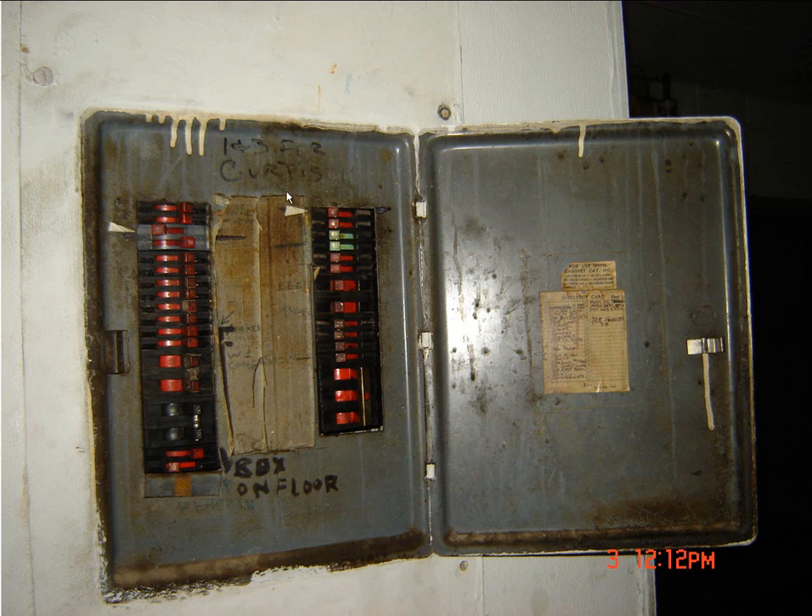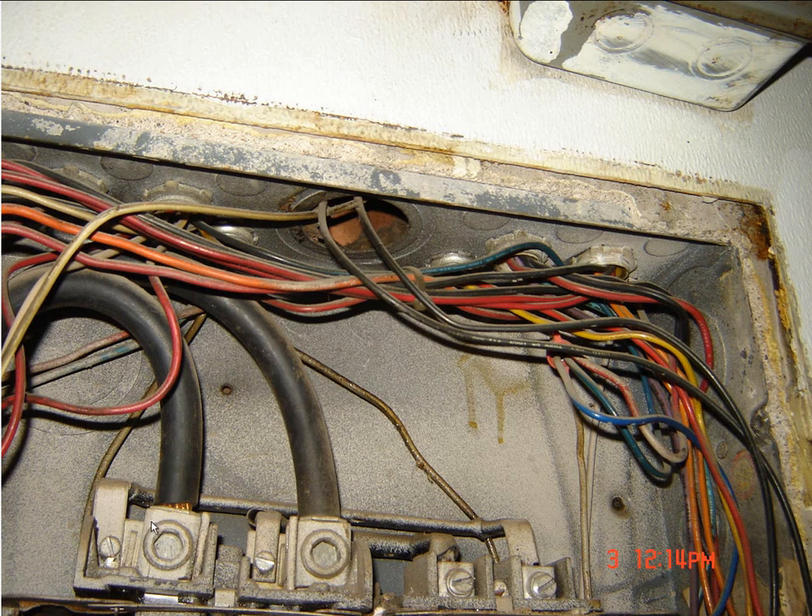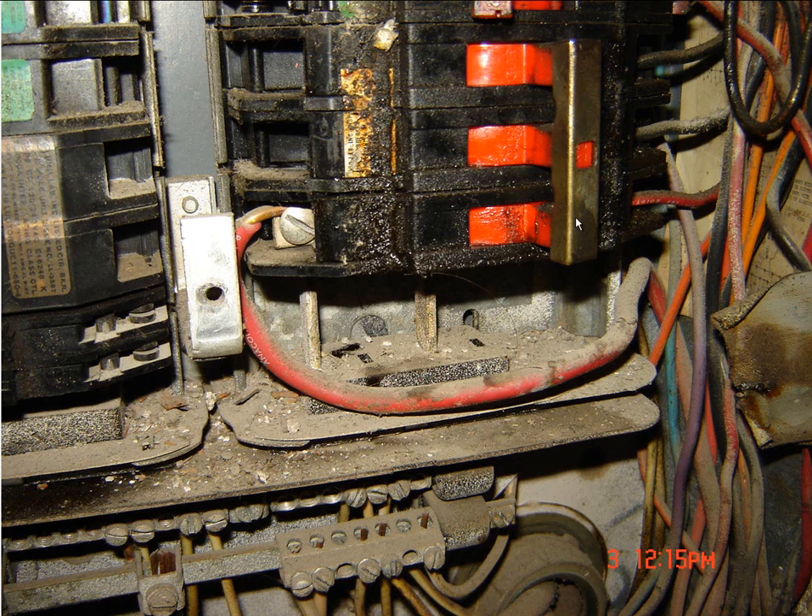Here's another one. In this particular panel, when I first opened it up, I took a look at it and thought — three-phase load center, Zinsco style? Holy cow, I've never seen one of those before. But then I took the cover off and found I have my A and B phase, and it's got its jumper over to the other side for the Zinsco style. This is a delta-phase breaker. This particular wire right here is a number eight solid, and it came straight from a three-phase service with a wild leg on it — the delta leg — with the three phases going out to the unit that this happened to be running.